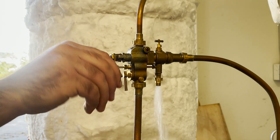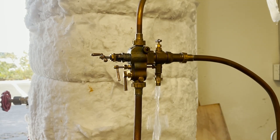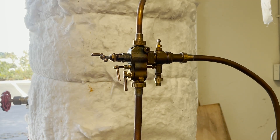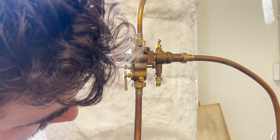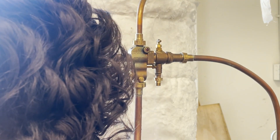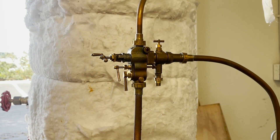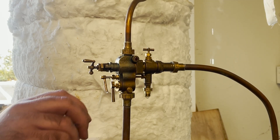Opening the primer and steam valve, closing the primer as the injector is trying to inject — it shakes like that because of the constant varying pressure in the delivery line, but it seems to be working. Checking the overflow to see if I can feel any vacuum being pulled, if there are any leaks there — it seems fine. I'm adjusting the capacity and listening for anything weird, but so far everything seems okay.